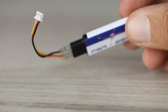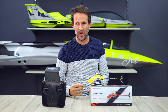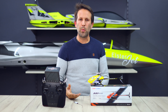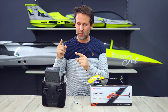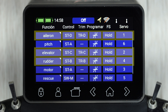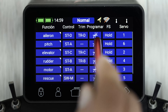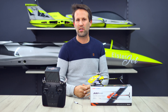Well it's lighter, which is always positive. This is achieved partly due to the new carbon frame and central aluminium backbone. It also comes with a new more crash-resistant tail motor, and a really interesting feature for those who are more of a heli pro — it has an adjustable length tail boom allowing for CG adjustments. To get it working with our Powerbox radio, the first step is to make up a connecting wire to go from the small white connector to a standard Futaba connector we can use with our receiver. It would be nice to see this come in the box, but it's an easy fix.